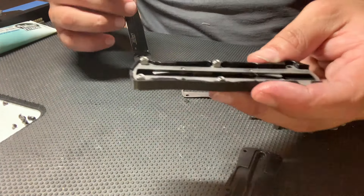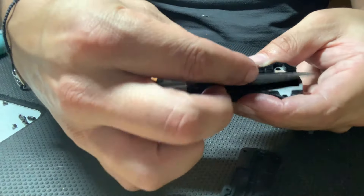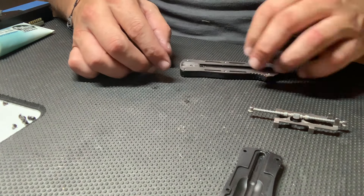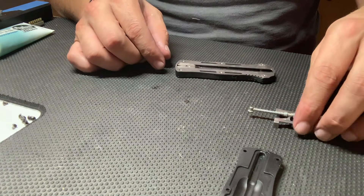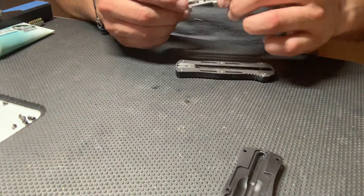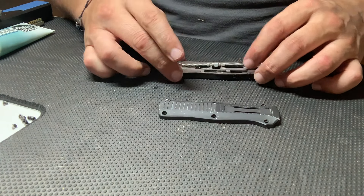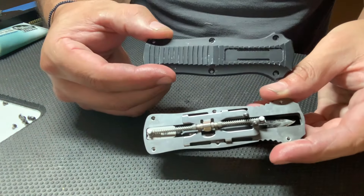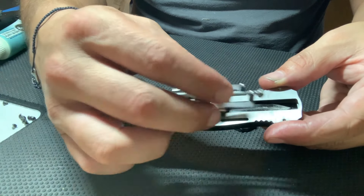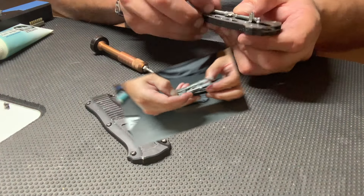It's key that when you put the blade in you don't put it in upside down. There are two sides and they're different — the blade goes with the circles and notches up, and then that piece goes on top, and then the spring mechanism that functions the button goes on top of that. I just put the spring in backwards, I adjusted the cap and now I know which way it goes — so I fixed it. Right now that spring is still loose — when you put the spring in you've got to make sure that the little arms catch at the bottom and that it goes all the way down.